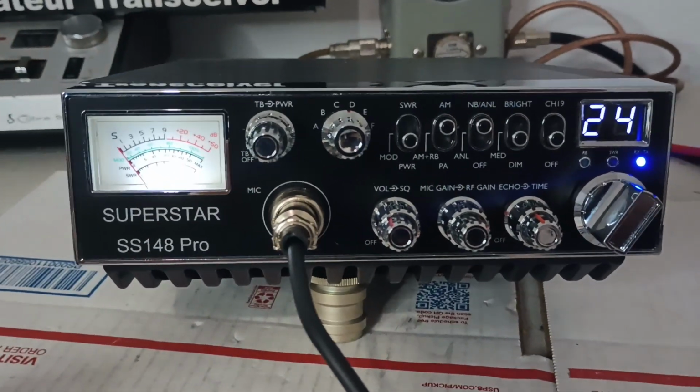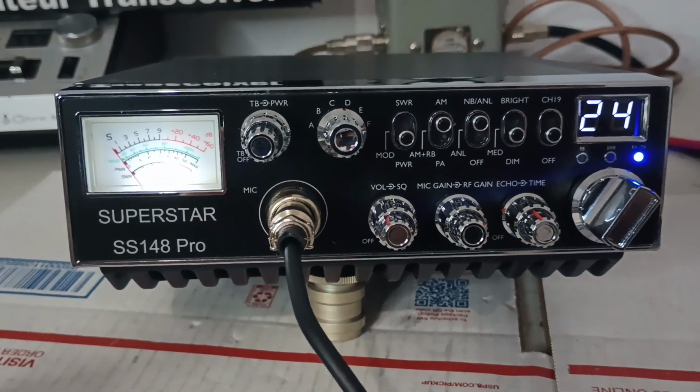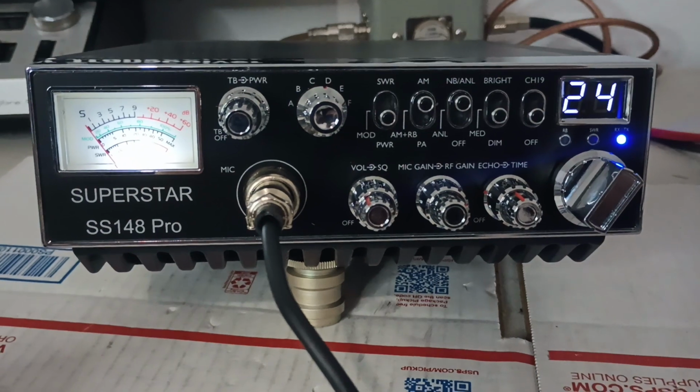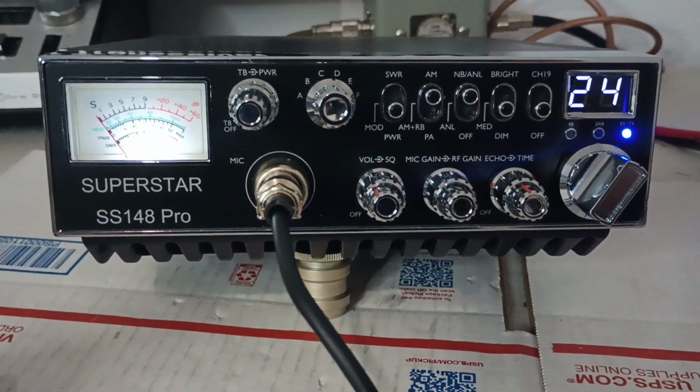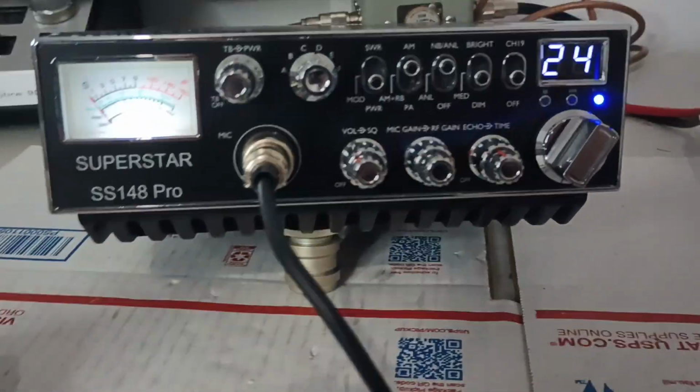You'll probably want to run it higher than that, more along the lines of 35 to 40 watts worth of dead key, and then let it swing that 500 PEP and 120 to 140 average. But a good swinging radio, as people would say.